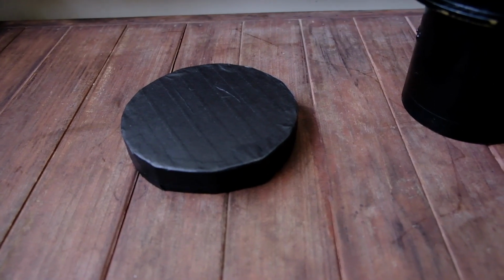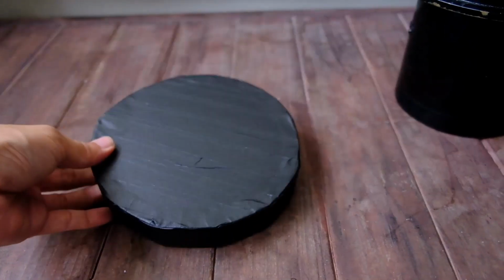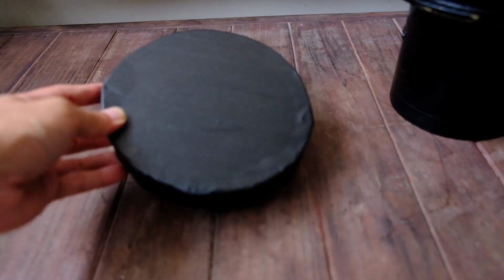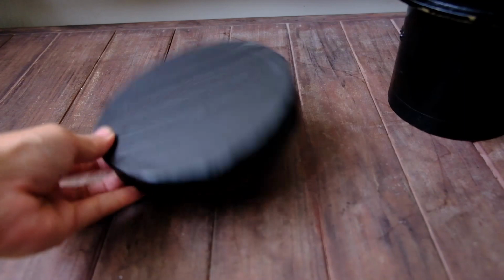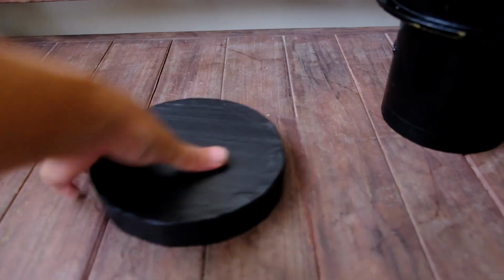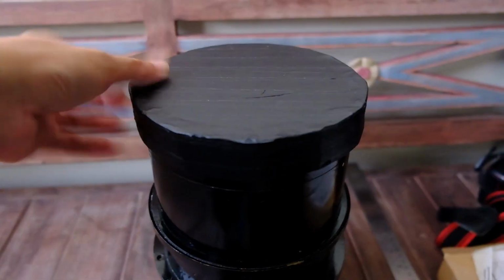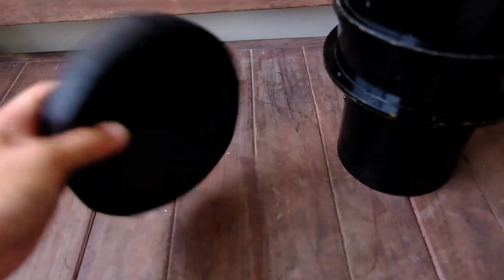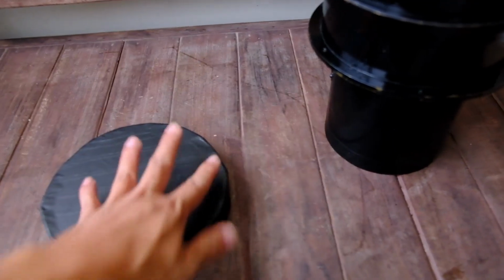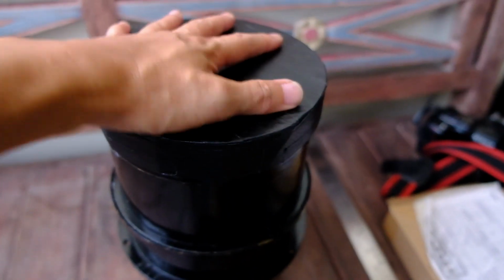As I mentioned, there's no shutter in the lens now, so I will definitely have to think of a way to control the exposure time. Of course, one way, since I will probably be shooting with photo paper, is to use a lens cap, because with photo paper the exposure time is usually in terms of seconds. So I can take the lens cap off and on the front element. For example, for an exposure of 1 second, I can leave it away for 1 second and then put it back. This is the lens cap that I have made using a piece of wood and some cardboard to form the rim, and I used black tape. Again, it won't win any design prize, but it will definitely be functional.